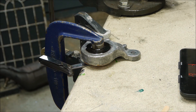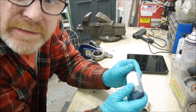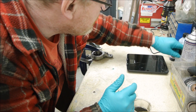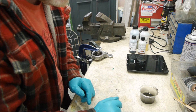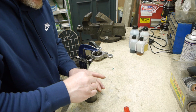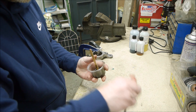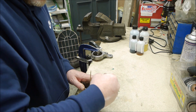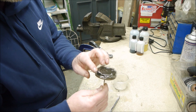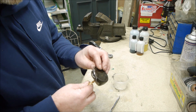It's looking better and it's not oozing out everywhere. The advantage of this is telling me if I've managed to order the right thing this time — this is a flex of 70. Now 70 is probably about your average engine mount. The upgraded ones are about 85, but I didn't want it harder than standard, I just wanted it normal. Let's leave it half an hour and come back. So about an hour in now — that's pretty well fastened in.